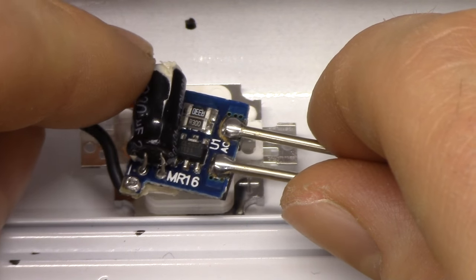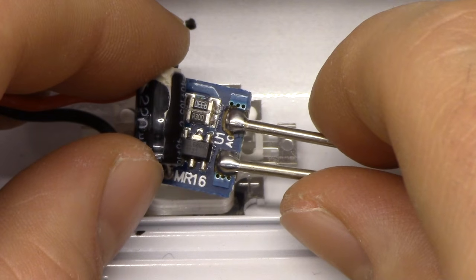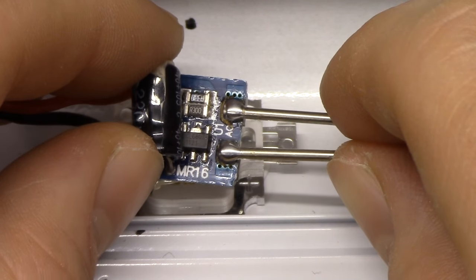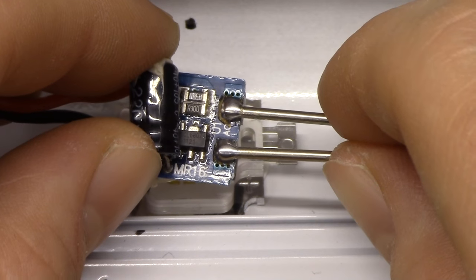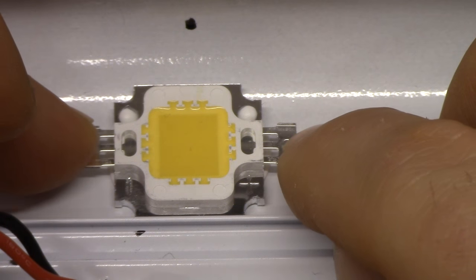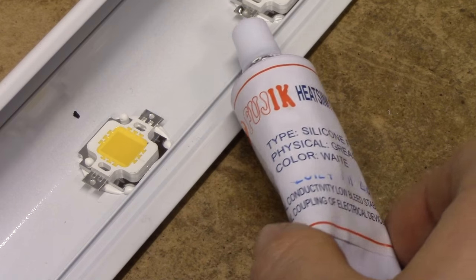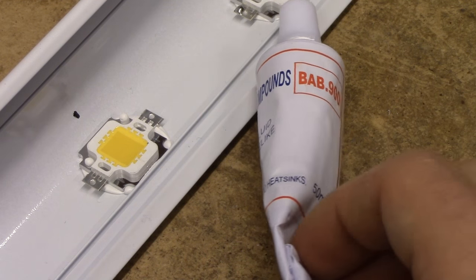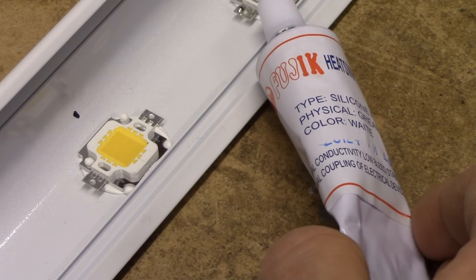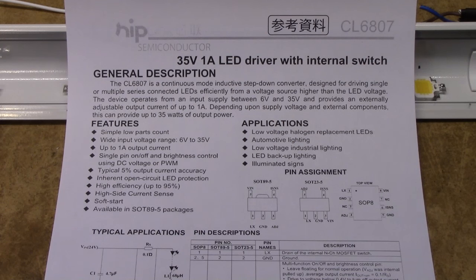I think I'm actually quite happy with the current configuration of about 600 milliamps. Even though I'm going to be using three drivers for seven LEDs, I really think it's going to help with power dissipation, since even though these LEDs are mounted to a big aluminium piece, it cannot dissipate an endless amount of power, and I am a fan of longevity. So I'm obviously going to underdrive these LEDs by almost an order of magnitude, putting out about 2 to 3 watts per chip. As for the actual physical mounting of the LEDs, I'm just using this Fujik heatsink compound purchased off DealExtreme — these tubes cost about $7 a tube, though you get a reasonable discount if you order several.